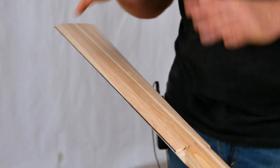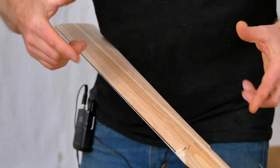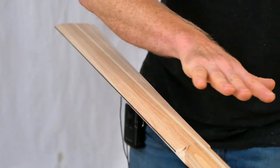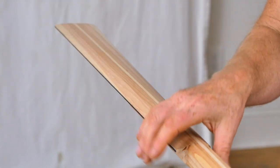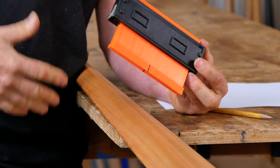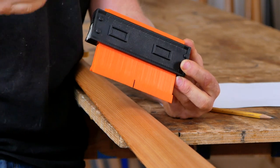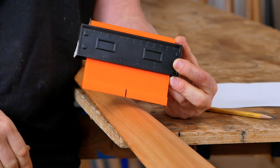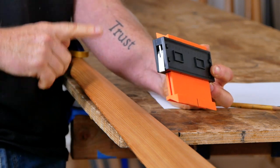Before we check the flex on the blade, there's one more bit of shaping you might want to do — carving the area around the root of the blade into more of a diamond or dihedral shape. As far as the water is concerned this doesn't improve the performance of the paddle, but it lets us save a little bit more weight and also improves the feeling of the hand grip. This is a good time to use the profile gauge I showed in the tool video. This step is optional, so if you don't have one don't sweat it, but it can be really useful to make sure you're not cutting away too much or too little material during the final shaping process.